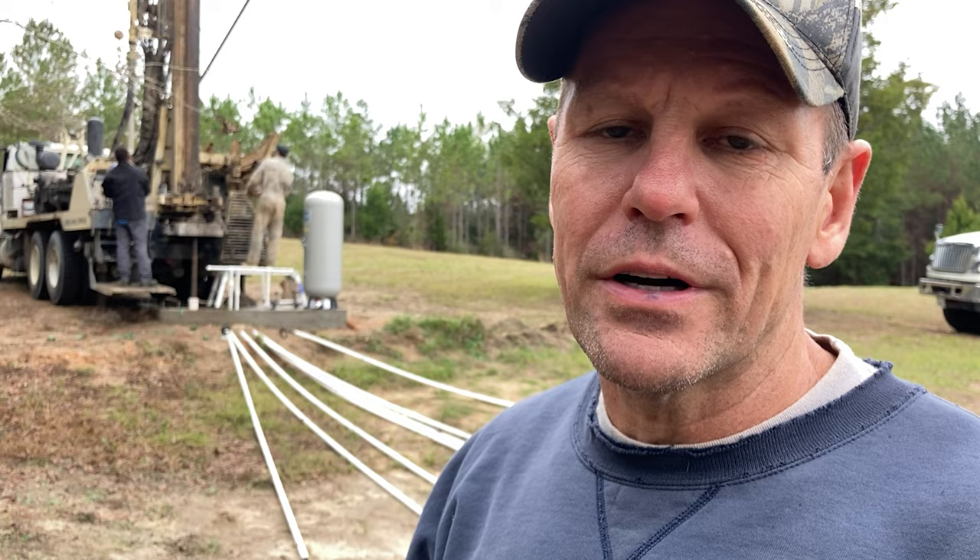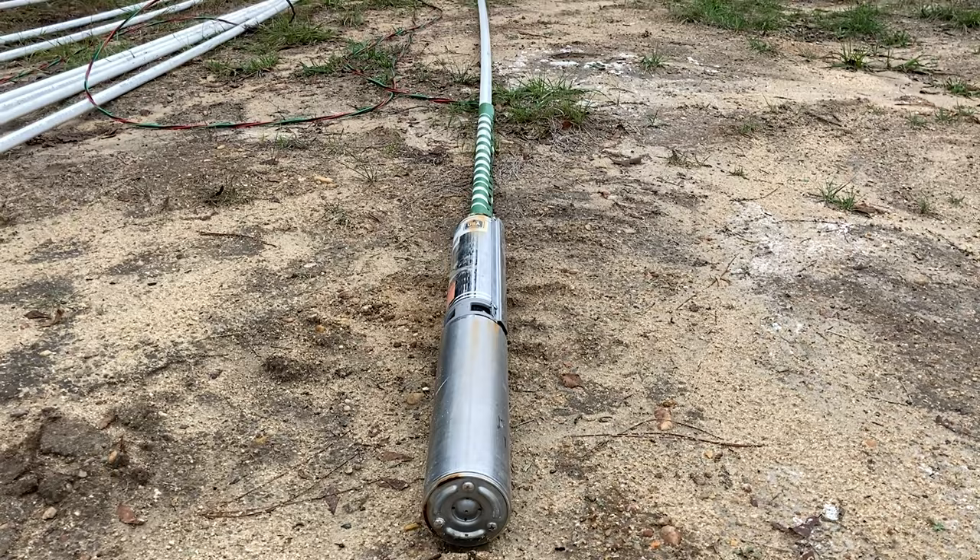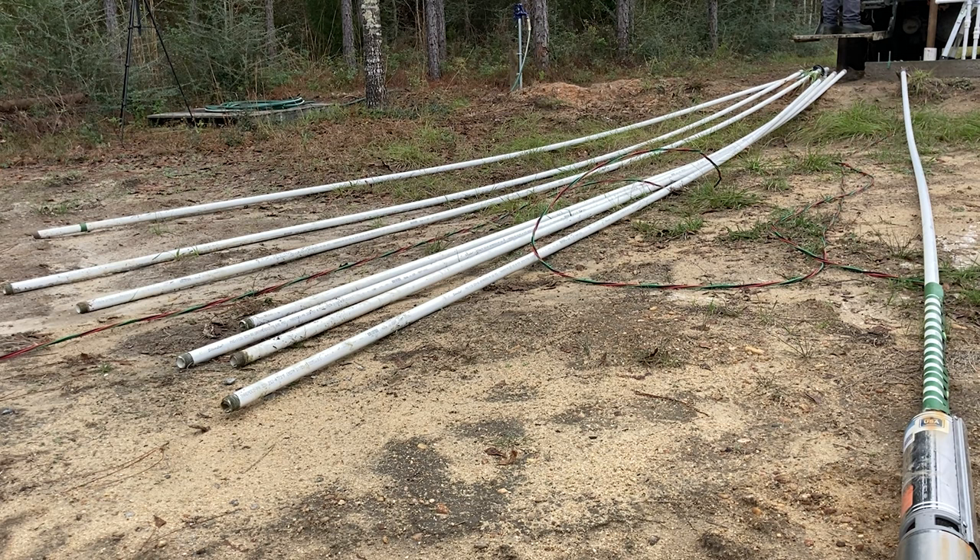What they were doing there is they got a drill head to drill into the rock, and they're just adding lengths of drill bit to the drill head. The very bottom of the well to the rock is 210 feet — I've been saying it was a 220-foot well, but it's 210 foot according to the spec sheet. We've got to put in 210 feet of drill bit to get down there. That's our well pump — it sits down 160 feet and sends water up through 160 feet of one-and-a-quarter standpipe, Schedule 80.